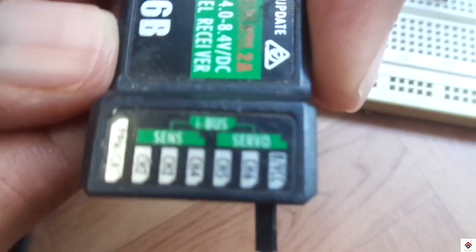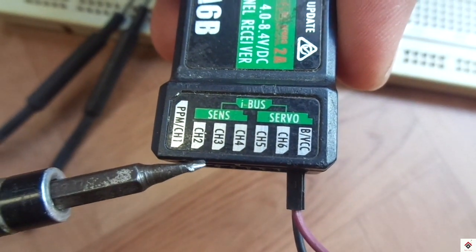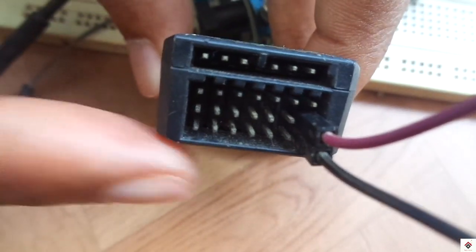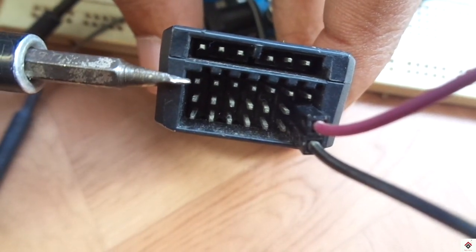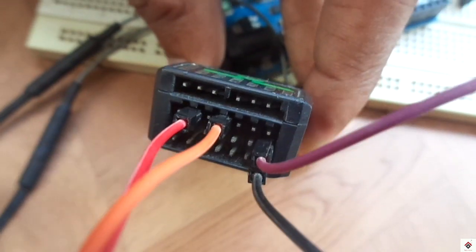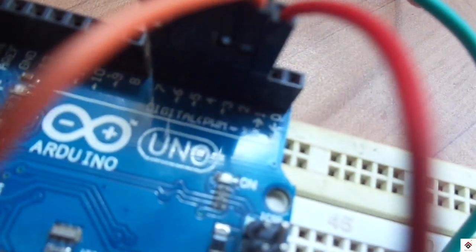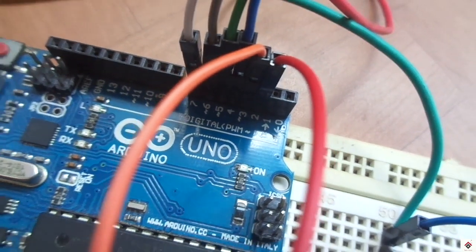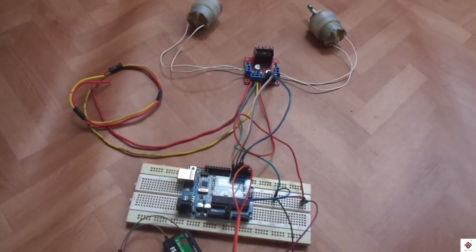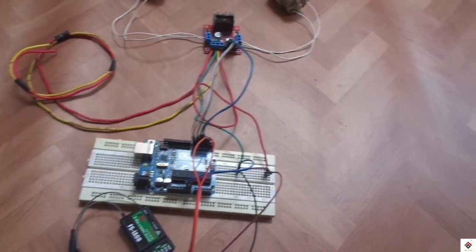Here we'll be controlling two motors with two channels, channel 2 and 4. So the signal pin, which is at the top, of both channel 2 and 4 is connected to digital pins 2 and 3 of the Arduino board. We are done with the connections. If you face any difficulties with respect to the circuit, you can get the circuit link in the description box.